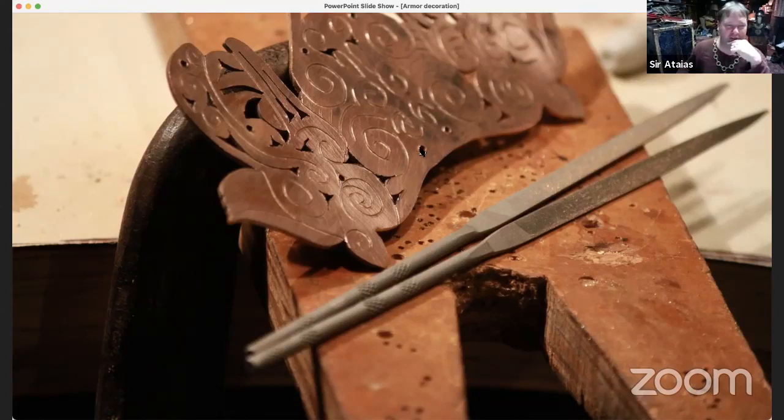And as far as the drill holes for putting rivets in, I'm sure you've done it. You drill a hole and you've got this big burr on the other end, and on both surfaces too, both going in and on the opposite side. So if you want your rivet to be flush, you need to get rid of that burr. And on the back side, you want to get rid of those too. You want a nice clean peening job on the back.